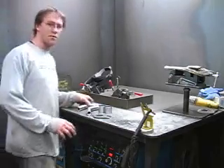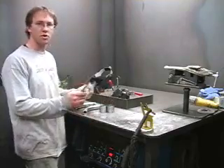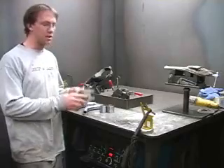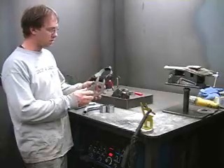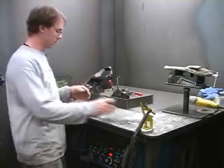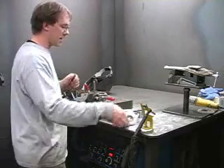Now it's time for the fun part — getting it all welded up. Our tubes are completed, our bushings are machined, and our ball joint plate is prepped. This is cut out of 3/8 P&O steel, which is a really nice material to TIG weld to. We've got the ends bent up so that it flows with the shape of the control arm, and we've got the edges all nice and smoothed over. All we have to do now is put it in the jig and get it tacked up.